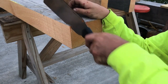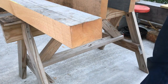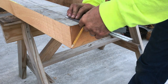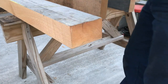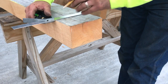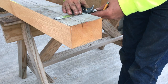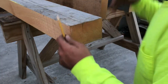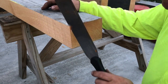All I'm going to do is cut this back, but only as far as the depth that I need it to - so I'm going to cut this back 3 and a half inches and square it off. You can see I cut this a little wider - I did that intentionally because I knew these edges weren't going to be very good. I'm going to square off the same side, because right now these sides are equally out of square, so I don't even have a decent reference face to work with. We're going to make one here just for the tenon and the housing portion.